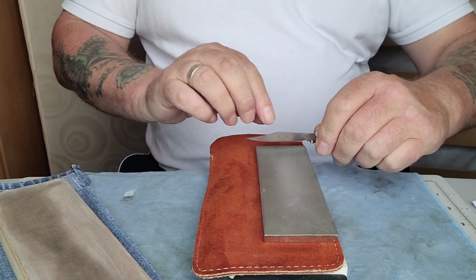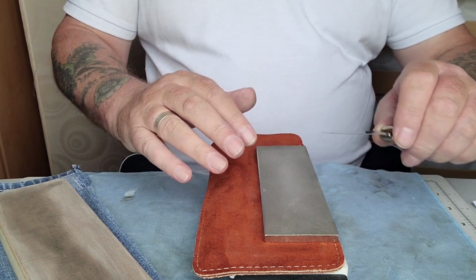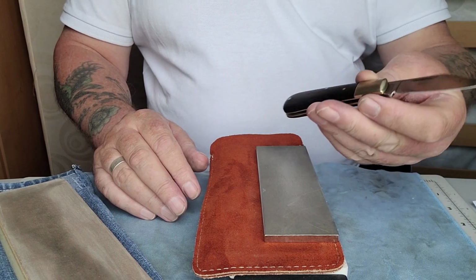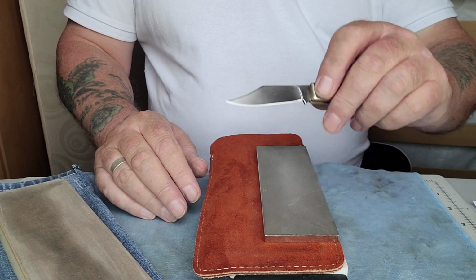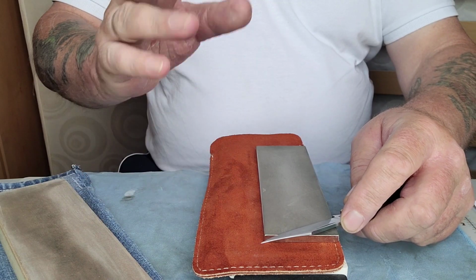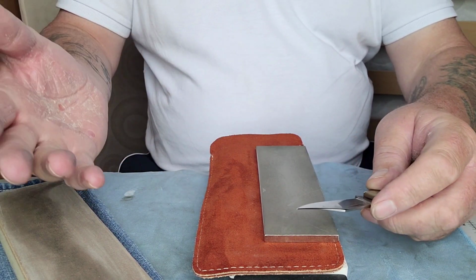So I'm just going to start. Now, there's lots of ways you can sharpen, but with a little Barlow like this, and it's carbon steel, I think when they were doing these ones, this is a fair age, this one now, it was probably C75 or something. I'm not sure, maybe 1095. But I know now Ashley, who runs it, he makes his own ones in O1 tool steel.